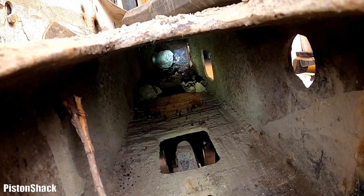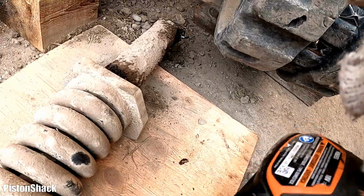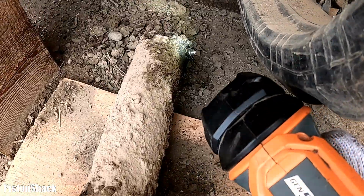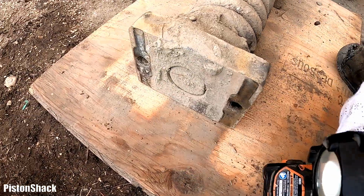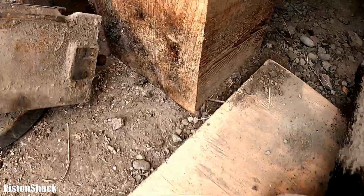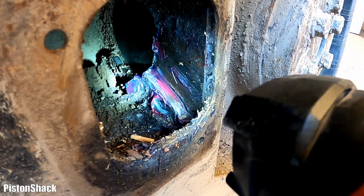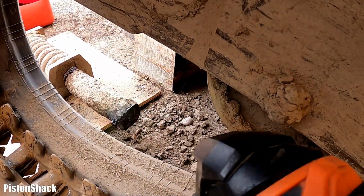As you can see where this cylinder was sitting and pushing on the idler wheel. Pay attention how everything was assembled. This narrow part is facing up to the top and grease nipples to the left. If you look from the back, this plate is facing out. You can see the wear marks here where the idler was pushing. And let's take a look inside, and on the very back of the housing there's an octagon shape bracket where that cylinder will sit and prevent it from moving around.